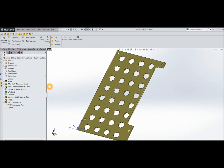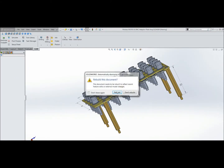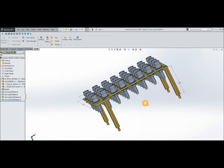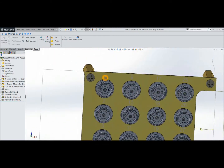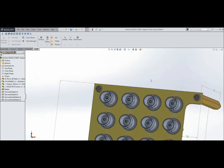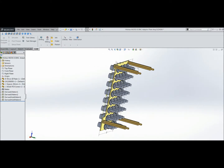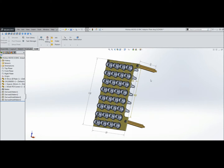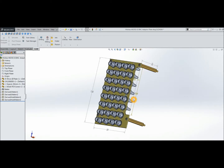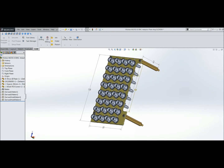So that's basically it. This is what the finished product is going to look like, with the number of each port just above each one — it doesn't show very clearly, but you get the idea. There are cables here, about 100mm overall length, that go down to the original customer interface, and the standoffs are about 50mm long. That brings it out to the correct position so that the customer never has to do this mating underneath again — they just mate on these simple connectors, which are much more robust than SMB connectors.